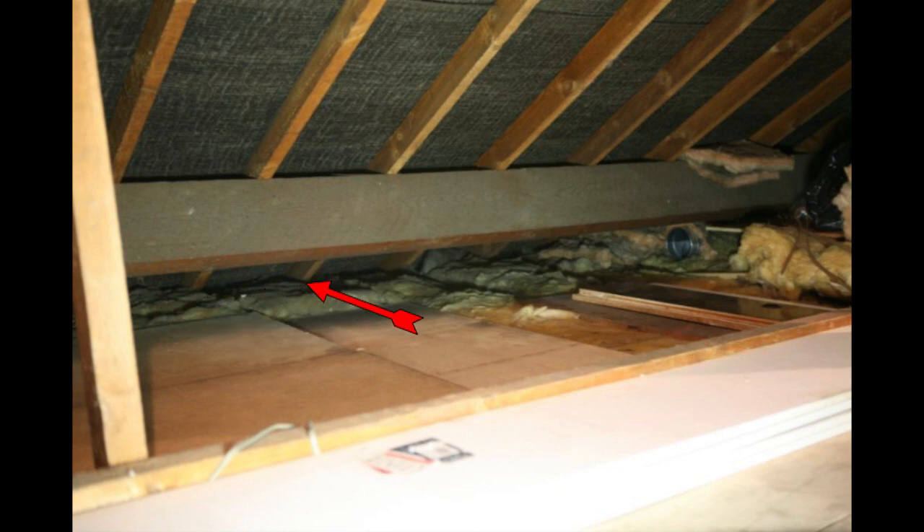The insulation stops here, just where it should — leaving a gap for the draft to come up from the fascia board and the soffit down by the gutter. This draft blows through the loft and is needed to remove any moisture that builds up there; it prevents damp and keeps wood rot away.